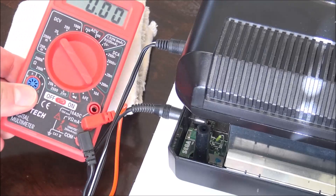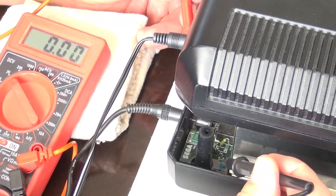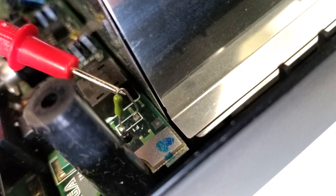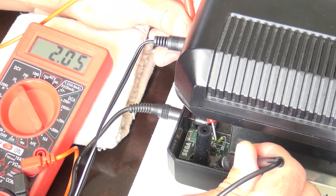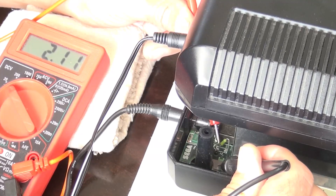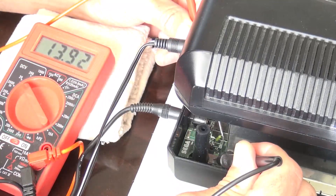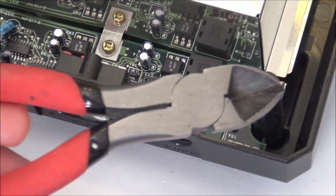Here's the second method to check if the fuse is the issue — a bit safer. Using a multimeter on the DC 20-volt setting, measure the voltage on each side of the fuse location. First find a grounding point: touch the black probe to the silver pad. Then with the red probe touch one side of the fuse — I'm reading 13.92 volts. Moving the red probe to the opposite end of the fuse, it should read the same if the fuse is good, but here it's reading 2.11 volts, indicating a power loss inside the fuse. Remember we're measuring voltage not amperage, and the voltage should be the same on both sides. Your readings may differ slightly, but they should still be consistent with each other on each side.